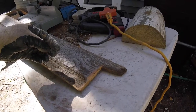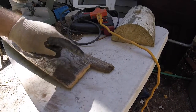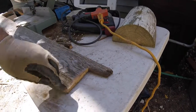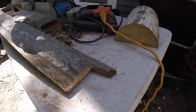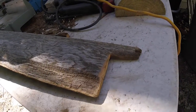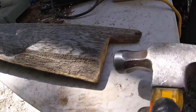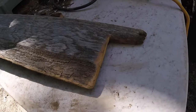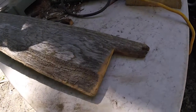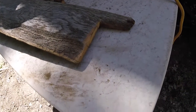This is an example that I'm talking about, where I'm cutting out a notch, and this part just had a corner on it. It didn't look very natural, so I just cut it where I wanted it. And you just take a hammer and just kind of impact the corners. And so that eliminates the need to sand anything down. And you get a nice little rounded, worn look, as if it was just like that before.